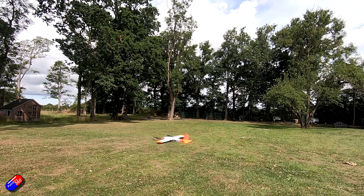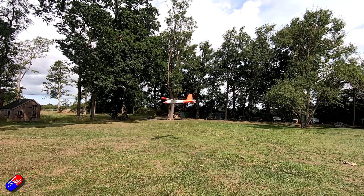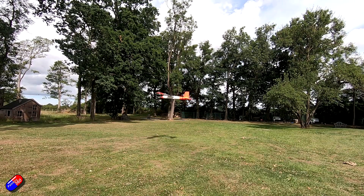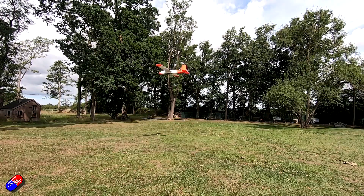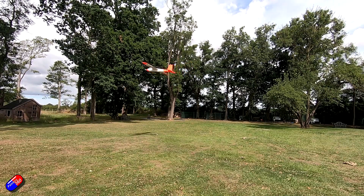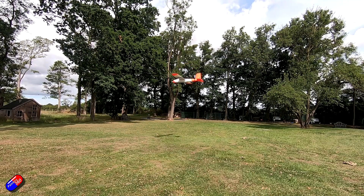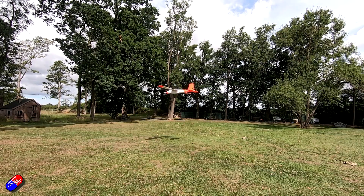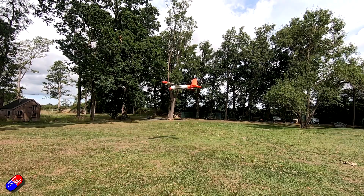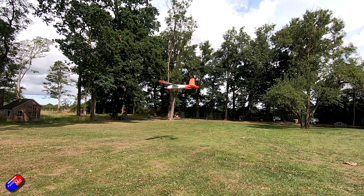This video is a live recording of going through a QuickTune on the VTOL built as part of this series. Ben has just taken it off, similar to the maiden flight. At the moment he's gently rocking it backwards and forwards just making sure everything is okay. He's going to keep it at about eight to ten feet high and then enable QuickTune. There'll be a notification inside Mission Planner if you're using telemetry, and you won't initially see anything, but if you listen you'll hear the vibration start.